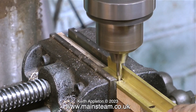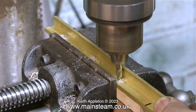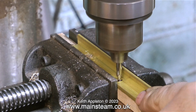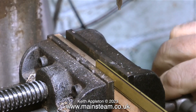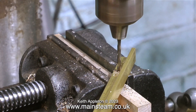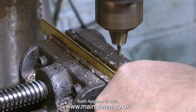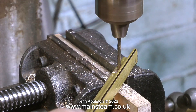As a beginner, it is very important to educate your eye. It is of course possible to achieve very accurate drilling of these parts, but it is so over the top for what this part's going to do - it's perfectly fine doing it this way. Sometimes it is very important to make sure the holes are 100% accurate, but in this case it's not necessary. This is a piece of brass that's been drilled, going to be riveted to the floor of a gas burner mounting in a model steam engine boiler. It is not a high precision part - it's not part of a satellite and it's not part of an intercontinental ballistic missile guidance system. What I'm saying is you can't just drill the holes in any old place; they have to be accurately drilled, but not down to the last micron. From a beginner's point of view it is very important that you learn how to calibrate your eye. This takes considerable practice.